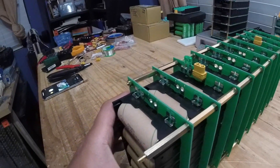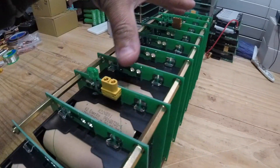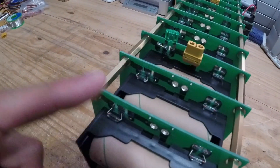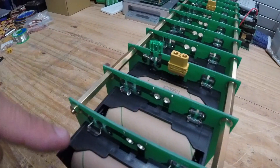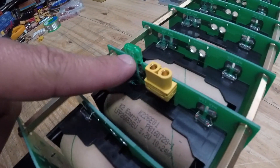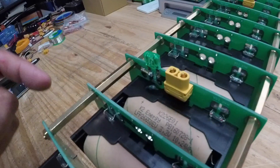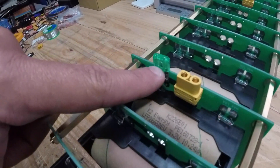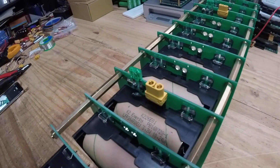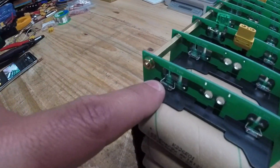Here are the 10 boards. These points here are where I'm planning to remove energy from the pack. The energy transfer goes from one board through these standoffs, then through these fuses. I had a 4-amp fuse trying to push 20 amps through it and it just melted — I'll need to use a bigger fuse. These new ones are rated at 30 amps, and with two of them I should be able to do 60 amps, more than enough for the 40-amp maximum the whole pack can provide, since each cell has a 4-amp glass fuse.